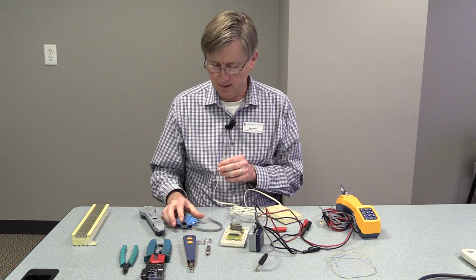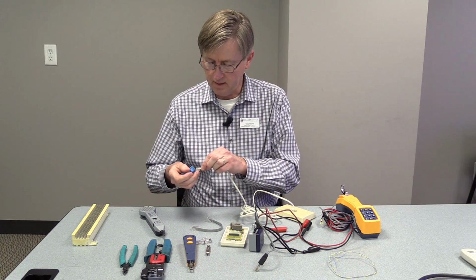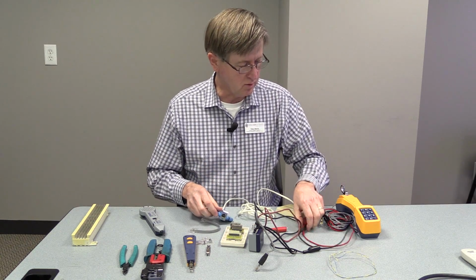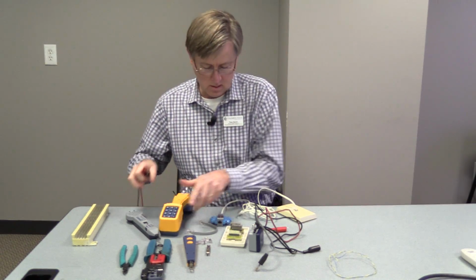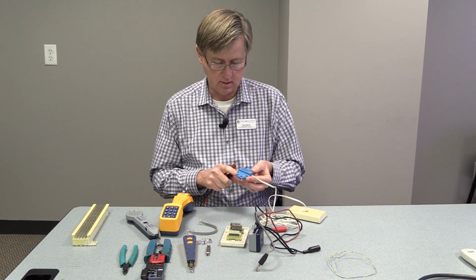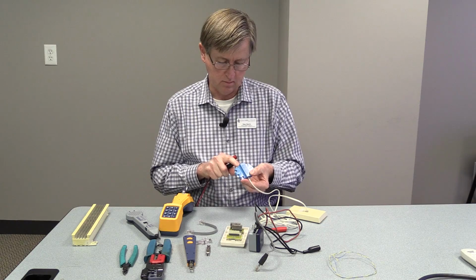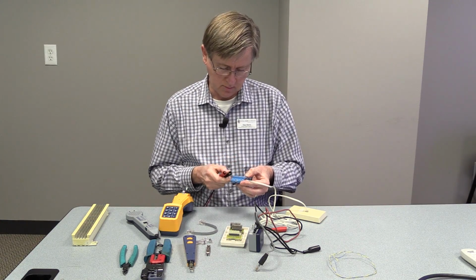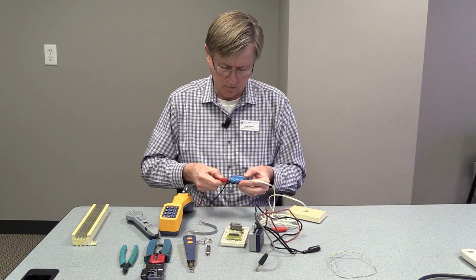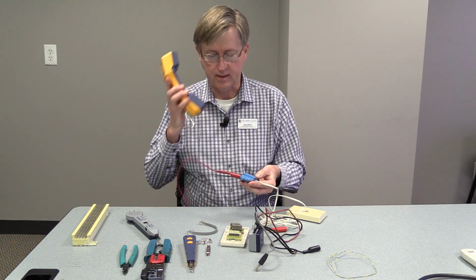if they're having a problem with the phone there and you want to test the dial tones, you can disconnect their phone, plug that wire into this device, and then you can use your handset and connect to these contacts here that are around. This will accommodate up to an 8-wire connector, and you can hook on to, well, we would hook on to 4 and 5 because that would be your inner pair, and you could check for dial tone on your handset.